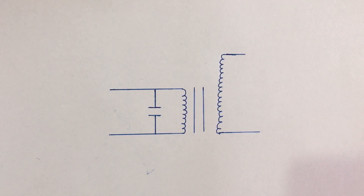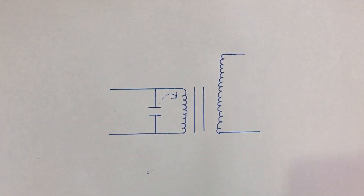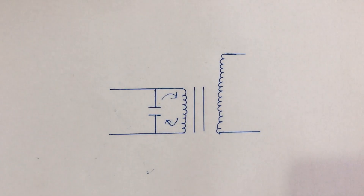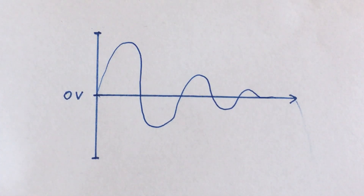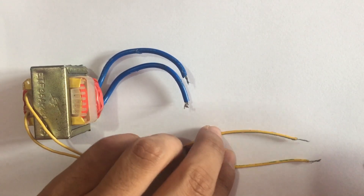To solve it, we can just add a capacitor across the primary coil of the transformer. The capacitor gets charged and it pours its energy into the inductor. Then the inductor puts its energy back into the capacitor, and they keep oscillating. The oscillation looks something like this. Here I have added a capacitor and I am going to pulse it again. As you can see, we have slightly stronger arcs at the output.